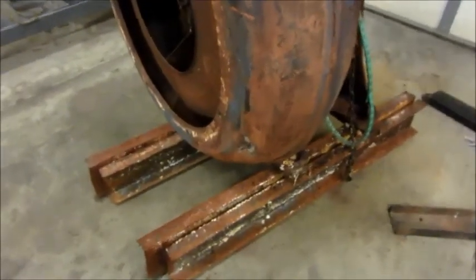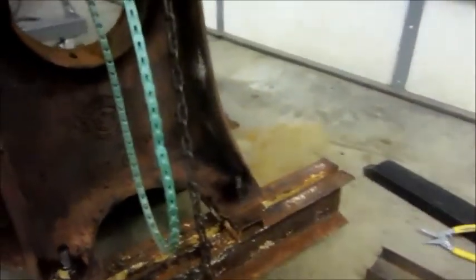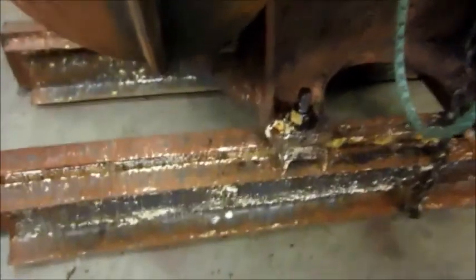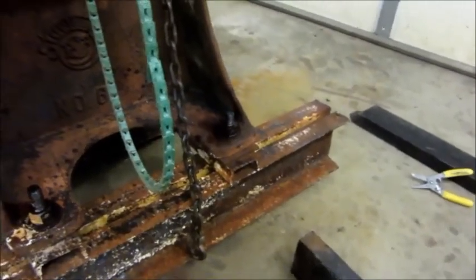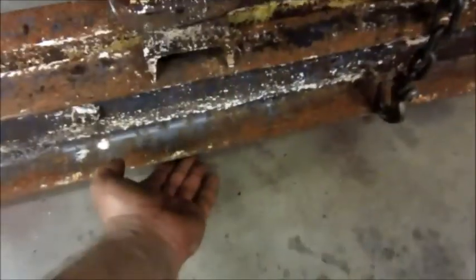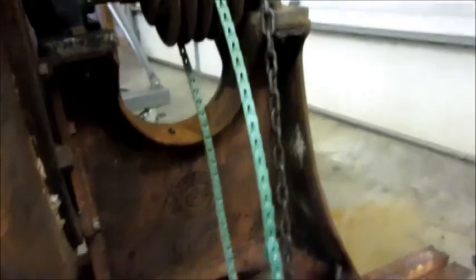I've been thinking about the base — the skid rails. I want to put the motor right here so you've got the blower and the motor kind of diagonal. That way none of this area is obscured, the back is visible, and the motor is out in the open. I can slide the rails back and cut off two pieces to come out for the motor to mount on. Underneath I'm going to put a wooden frame of 4x4 posts, since the bolts go all the way through and can't sit on the skid rail. With the wooden beam I can also put some good casters to make it mobile.